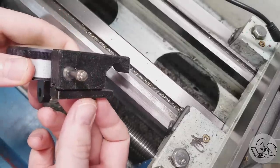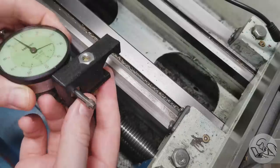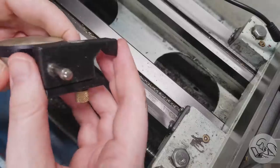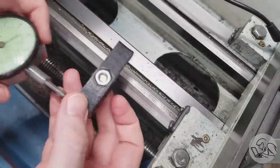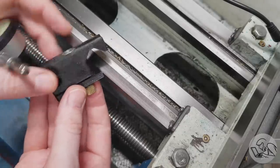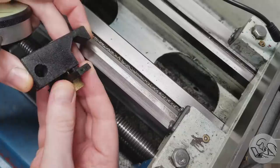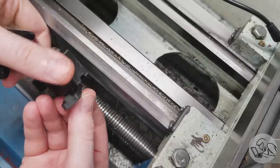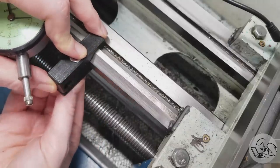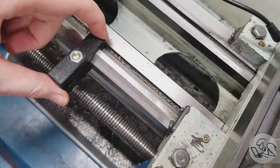This is what I'm using currently. It's 3D printed — I'll put a link to this on Thingiverse down below if you'd like to try printing your own. This worked okay; I've used it for a couple of years. It holds an indicator with a friction fit, which works fine because of the plastic, and there's a nut pressed in the top for the brass clamping bolt. The two main issues are that it's fiddly to install — there's a mortise and tenon arrangement that requires you to rotate it, seat it, fish it into place, and then tighten the bolt.